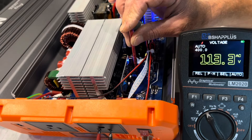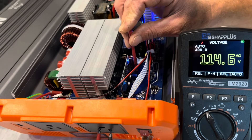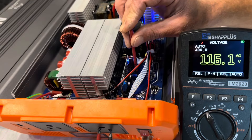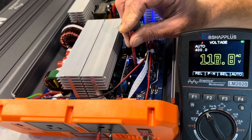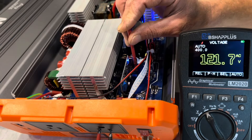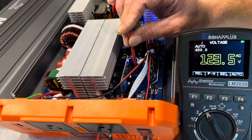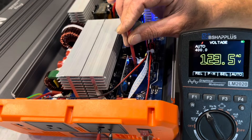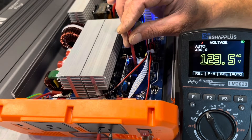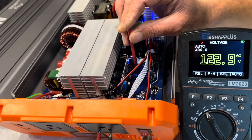I'm going to turn it clockwise. I'm going to try to get to 123 — that's where I like to set these inverters if they've got an adjustment. I stop at 123 if they're adjustable. That way you've got a little bit of extra punch so when you hit those big loads, the voltage doesn't drop. Just sitting here fine-tuning it to get exactly what you want. It's very sensitive. Right there — 123.